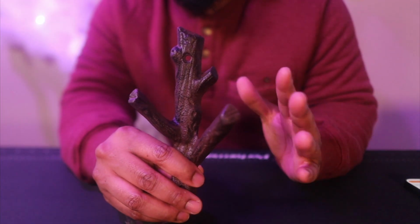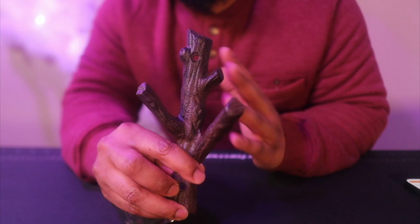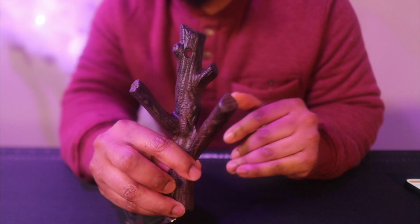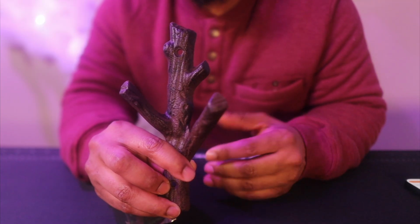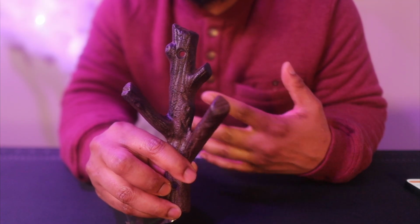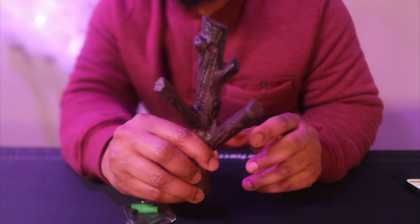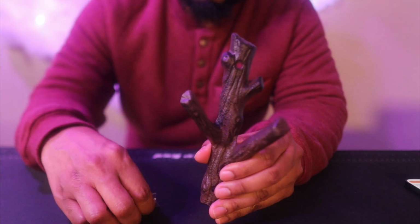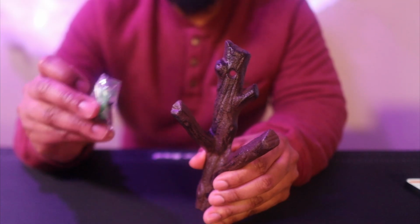All right. If you could find a stud, get yourself a stud finder, screw onto the studs. That's the best thing you can do, you guys. Screwing onto the drywall by itself with the anchors is fine, but it's just best to go ahead and hit the wood, you guys. So look for a stud if you can. If you can't, then use your anchors. Definitely use your anchors. If you don't use anchors, you will be sorry.